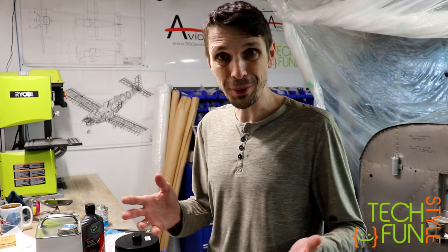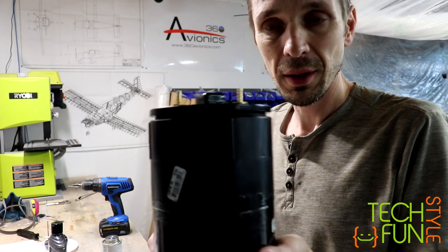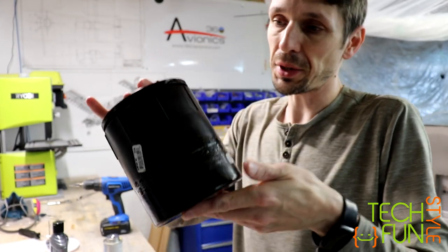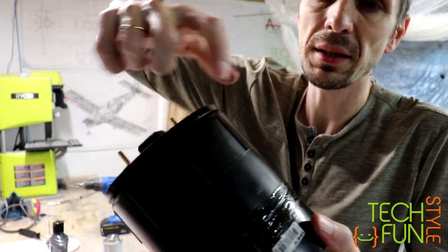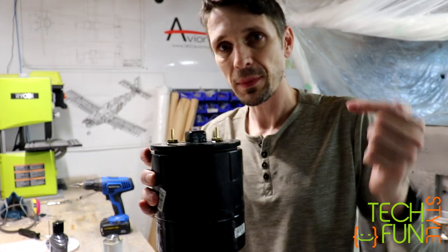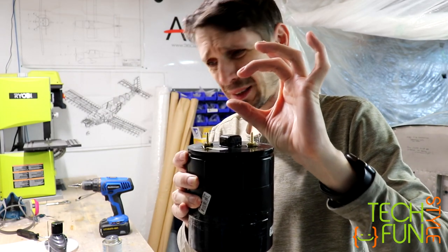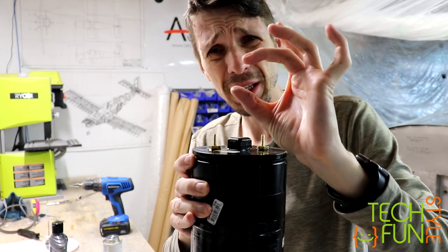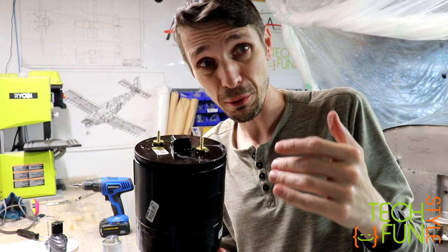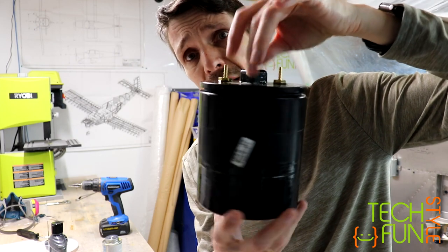All right, let's continue to work. So that's our chamber, the vacuum chamber. As I said, it's done already, ready, prepared. So this one I can remove. It has the rubber seal around and two hoses, inlet and outlet: inlet from the mold and outlet to the pump. I know that basically I need that little manometer, barometer gauge, but we will see. Maybe I don't need it, maybe I need it just to be able to see the vacuum. Maybe I have something here I'll install. Otherwise, that's the chamber, I'll let it dry, and it's done.